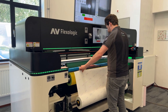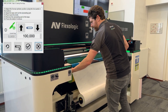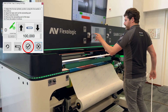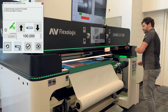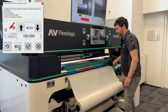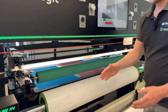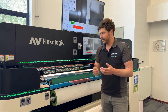I apply the tape just a little bit over the middle of the center line, then cut exactly at the center line. Using the menu, I lower the pressure roller, then let the sleeve rotate exactly 360 degrees. The tape is applied and the pressure roller comes up automatically. Then I use the cutting knife again — and the tape is applied. You can see you get a perfect seam. Because you cut at zero, rotate, and cut again at the same position, you don't have any overlapping parts. It's a very quick and easy process.